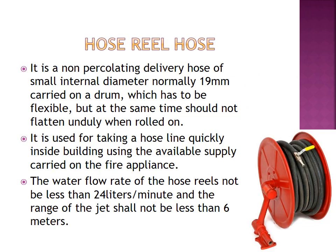We can also divide the lined hose into different types. Type 1 lined hose means the lined hose without external jacket treatment. Such hose absorbs liquid into the reinforcement jacket and requires drying after use. The second type is the coated lined hose. This has a thin elastic outer coating that reduces liquid absorption into the jacket and may slightly improve abrasion resistance.